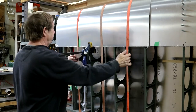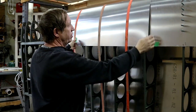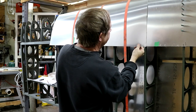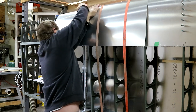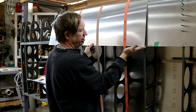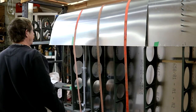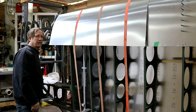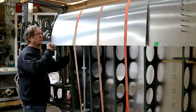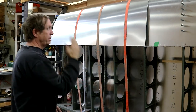With the tie-downs pretty loose, I can take this clamp off. We can make sure the sheet is where we want it right to left by using those marks we put on there. I know I'm pretty close to where it needs to be rotated around the nose because these two marks are pretty close to the same. So now I can look inside and see where we actually are. I'm going to start tightening from this side because it's showing me it's skewed a little bit that way.